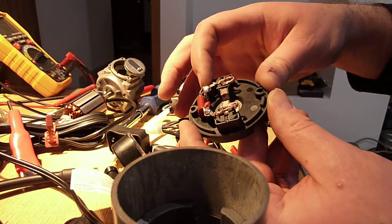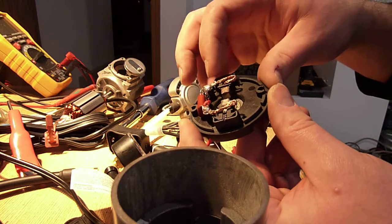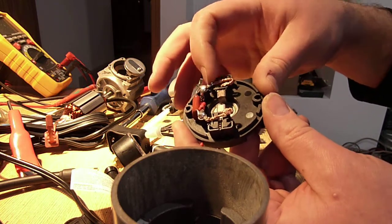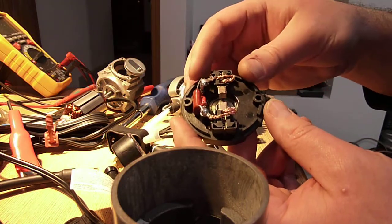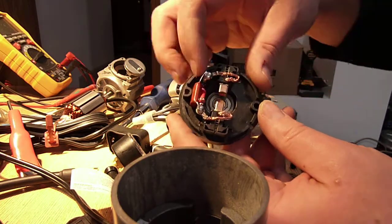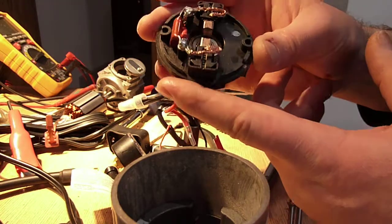The screws are not going to work loose because they are literally held in place by solder to the solder lugs. So all this stuff is soldered together. If it was just solder I would say it probably wasn't adequate, but between the screw and the solder — that's definitely not going anywhere. This capacitor is soldered on as well, so I'm pretty happy with that.